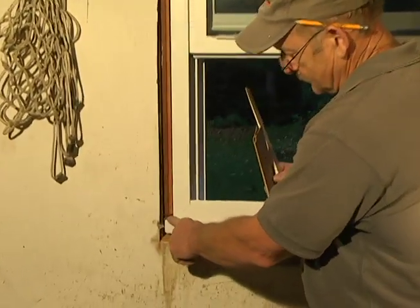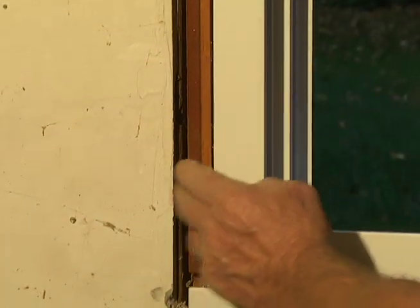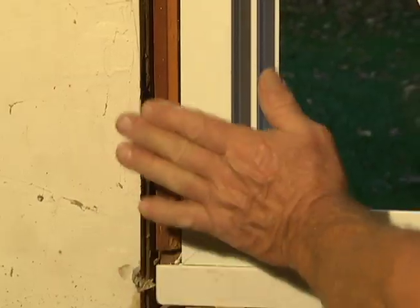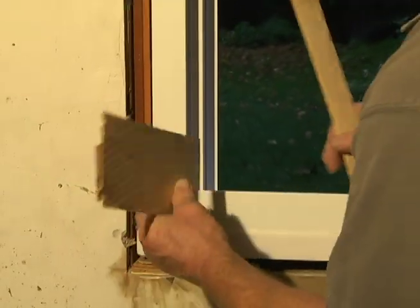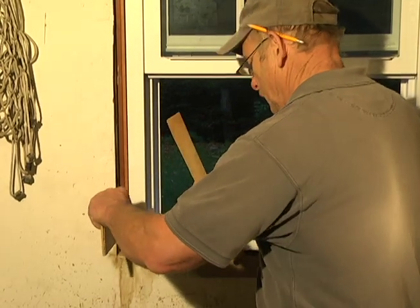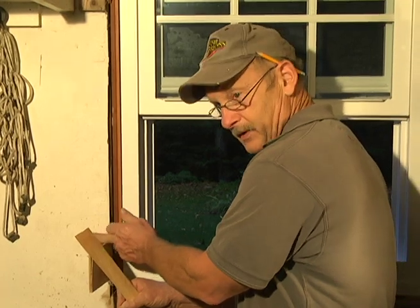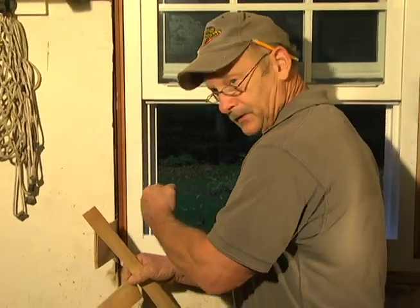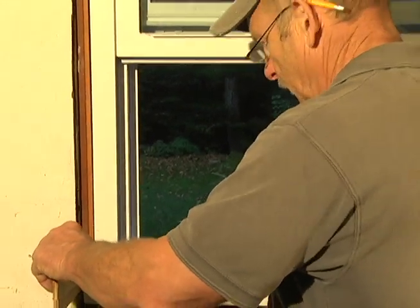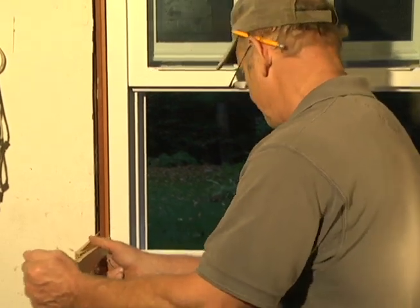when we cut the old sill out, the existing window frame, which is holding our unit, the bottom is a little bit loose. So we're going to utilize our screw, which will go right through the frame of the old window into the framing of the house. So that'll stiffen everything right up nice. So here we go. We put where the screw goes, right there. And we're going to put one between the new window and the old window frame.